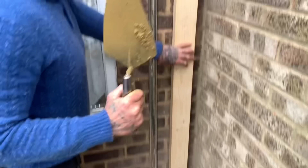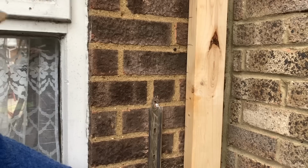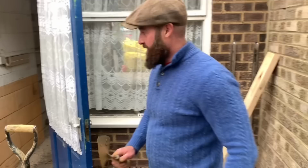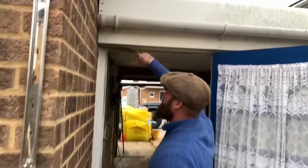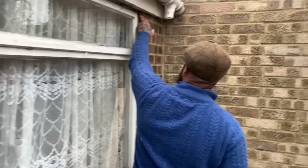Now, this brickwork is low to the gauge marks. So theoretically, it's half courses. Again, so in the existing build, there's a discrepancy, what we call in terms, there's a pig in it. So I'll tell you how I noticed earlier. If you come round there and see this header frame, see this header frame there, it matches really the top of that brickwork there. And then when you match the header frame round here, it's up about 25 mil.